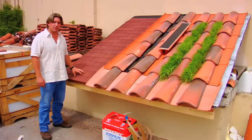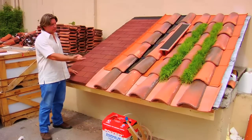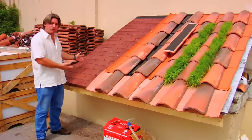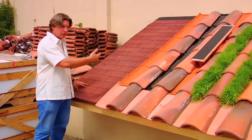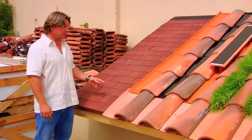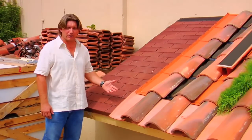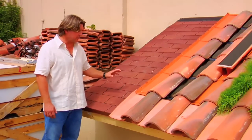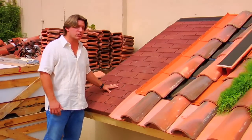Roughly 85% of the re-roofing market is asphalt shingles. Here we can use this hybrid system as a retrofitable application over the existing shingles, and be able to add the PV and the green roofing as well. We'll also be increasing our thermal mass, making our roof more energy efficient. We will also be able to have the same wind attachment resistance as you would have with this system over an existing shingles roof.